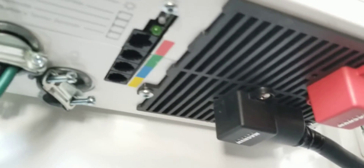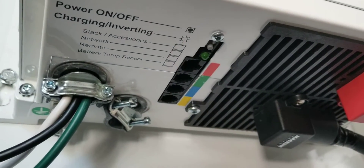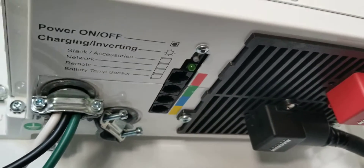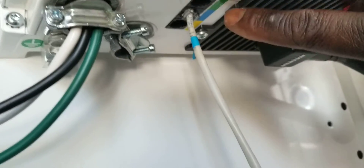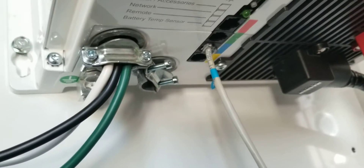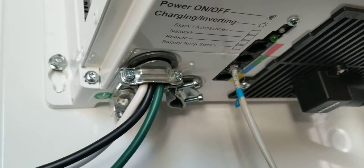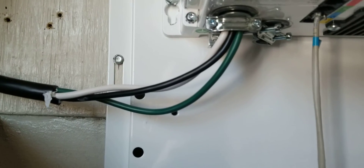Magnum makes it easier for connections. If you look down here there's color coordination — it tells you for everything where you're supposed to plug in. Even if you can't read, you can go according to the color. The cord says 'remote' — blue. Green tells you what it is. Red is for stacking, yellow is temperature sensor, green is for network, blue is the remote.